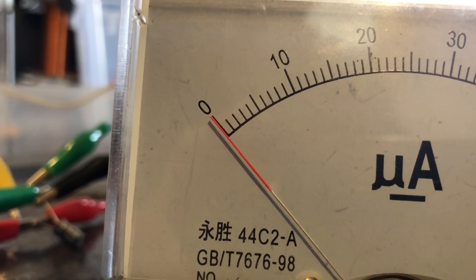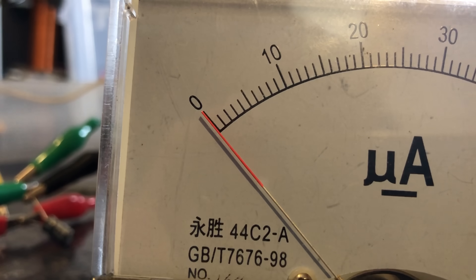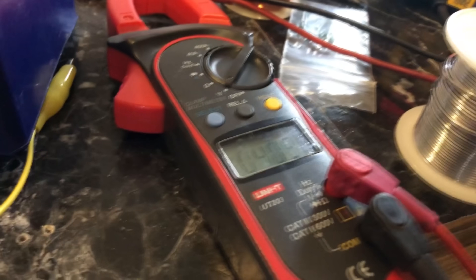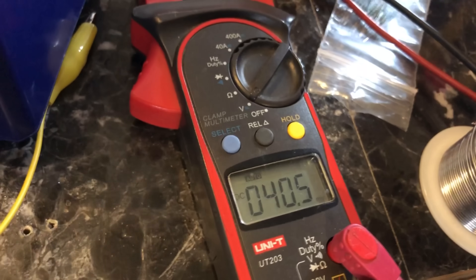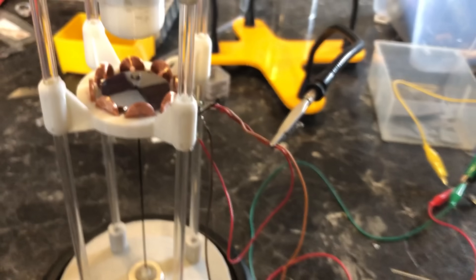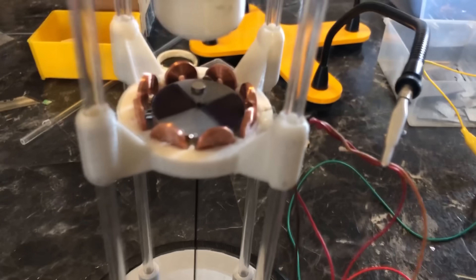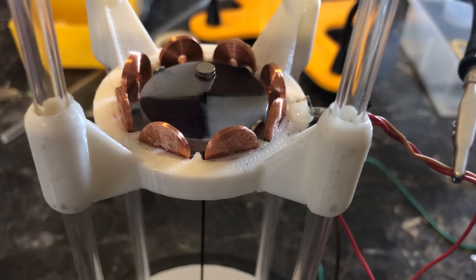It was right at this point where one evening I decided to run some calculations, assuming the motor was drawing a quarter microamp at 40 millivolts. I started calculating how long this motor would run on a standard AA battery that had 3.6 watt hours of energy. The numbers — thousands of years of run time — just blew my mind. Correct me if I'm wrong in the comments, but this motor is running on Tesla's last breath, folks.